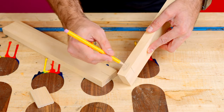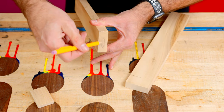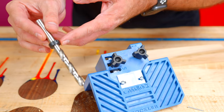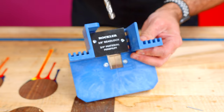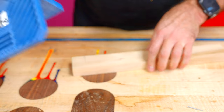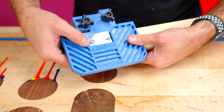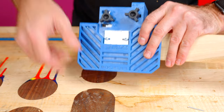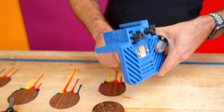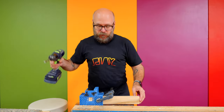We want the floating tenon inside there like that. I already have my line marked in the middle. On the inside, I know that I want my tenon to go in there and my tenon to go in here. This jig comes with the drill bit that you need — it's got a depth stop collar on there. I set that using the handy little guide on the back of the jig. This is going to get clamped to the board. I will line that sight line with the line that I drew, clamp this down, and drilling those five holes will give us the mortise that will accept this tenon. I've got the jig clamped to the board and I'll throw this in the vise and drill out those holes.